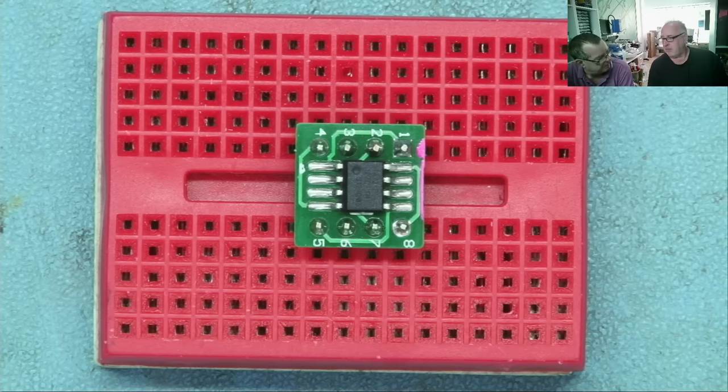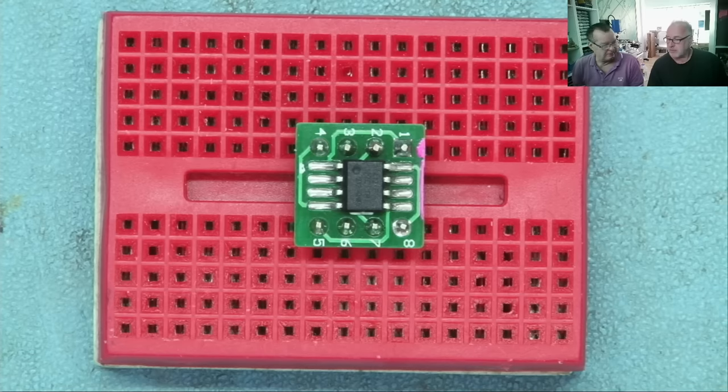So what made the program so big? Because it's just monitoring voltage and current like Mr. Bleep does. Yeah, this is a complex thing to control the OLED. You have lots of working parts in there, and the character set, which is just numbers and some dots, is about 8 kilobytes. So you have no chance to do this in a 4K CPU. We need to think bigger. So basically, because of the amount of data we need to store the alphabet and numbers, it has nothing to do with the code. So we get rid of that and we show you a working thing.